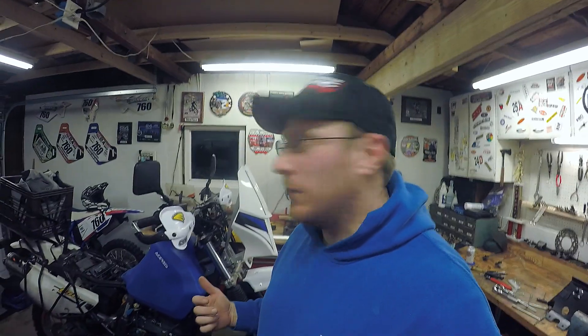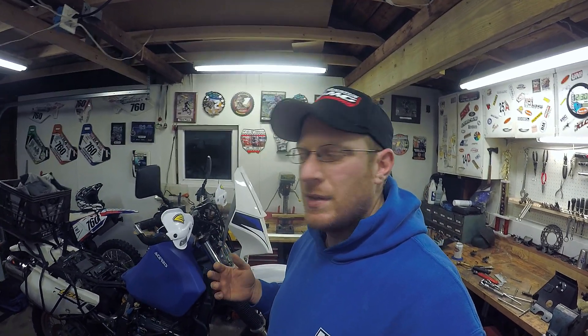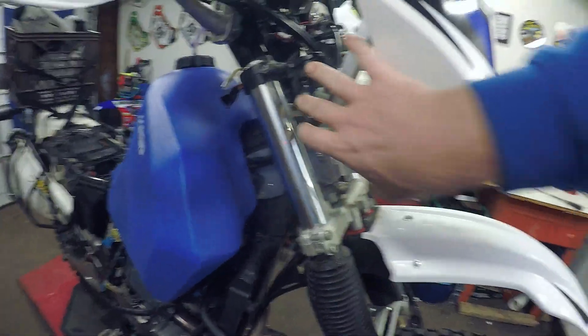I'm happy with how it's coming out, I just need to make it more idiot-proof. Version 1.0 probably won't be crash-proof, but version 2.0 might be — I might use these measurements to make it out of HDPE, basically cutting board material, though aluminum will have a lot less vibration than HDPE. I just need it strong enough to hold the light's weight without loosening over time. I'll weld the frame but keep these three mounting points bolted so I can replace parts if I crash.